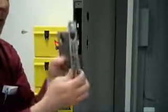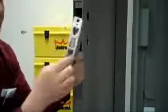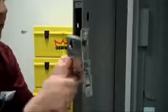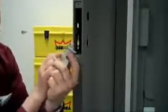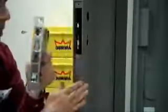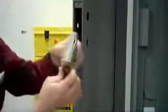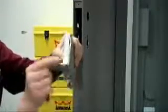There's one more adjustment we need to be aware of when getting ready to install this. When handing is involved, we need to make sure that the curved face is facing the strike plate and that the screws are facing the inside of the door. On the top and the bottom, you can loosen this screw and twist the lock front to match the bevel of the door. This particular door has a square edge as opposed to a bevel edge, so I want it in the middle, which is where it is currently. If you had a bevel, you would loosen these, twist it to match the bevel, and then re-tighten the screws.